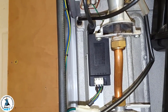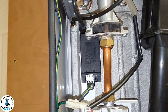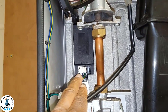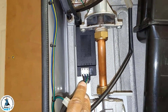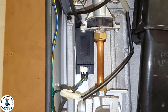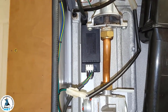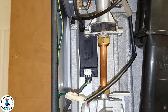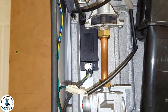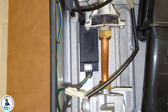Regarding the spark generator — basically all you can do is put your multimeter on there and test it. Turn the boiler on, pull this off, put your multimeter on the brown and blue, and check your voltage. If the voltage is there it's going to be the generator; if it's not, it's going to come back to the board. You can also hear the spark — if you can't hear it, that's a good indication it's the spark generator, but check the voltage first to prove it's getting to it.